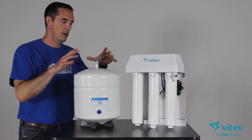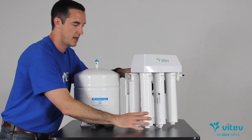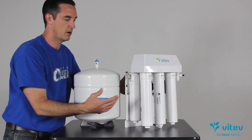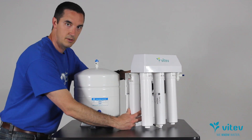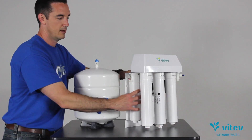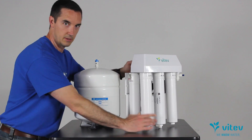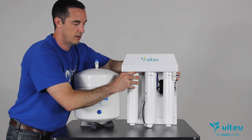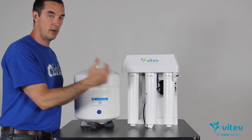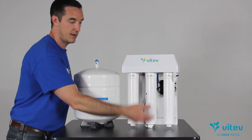Just a real quick overview. RO systems are all going to have some sort of pre-filtration stage — more accurately, pre-membrane. The membrane is the heart and soul of an RO system and it must be protected. The sediment cartridge, which is usually your first stage, takes out the big chunks — sand, sediment, rust — so that the membrane doesn't clog up faster than it otherwise will. Then you have another stage, a carbon filter most likely. Carbon has typically been used to take care of chlorine, and now a good high-end carbon is needed to protect from chloramines, because chloramines will actually eat away the membrane.